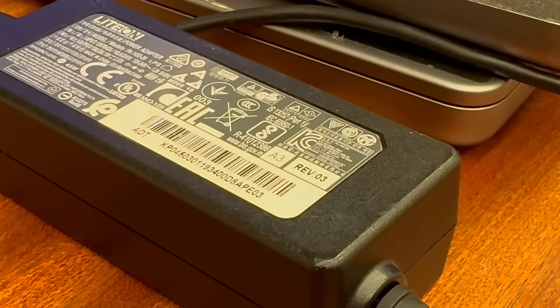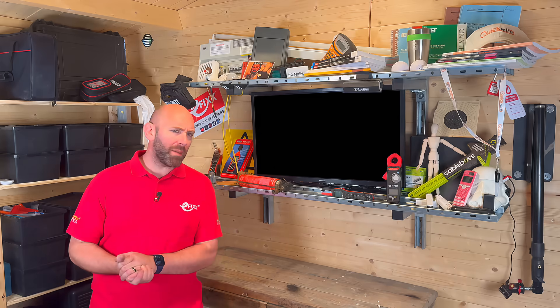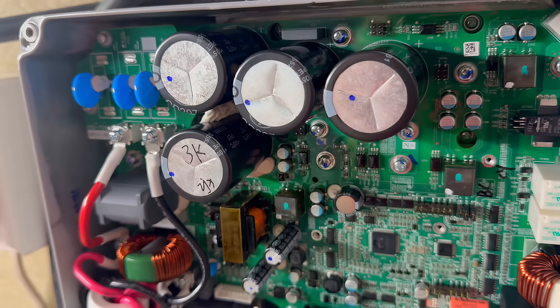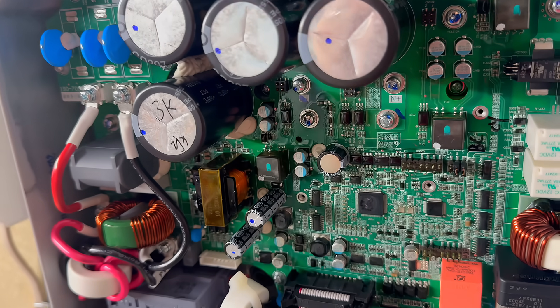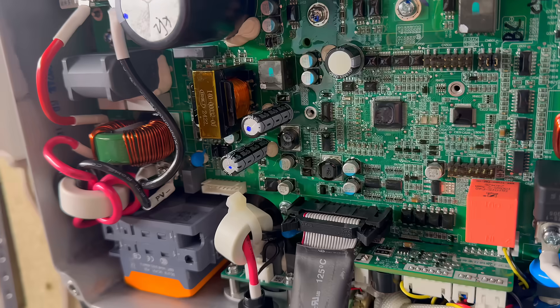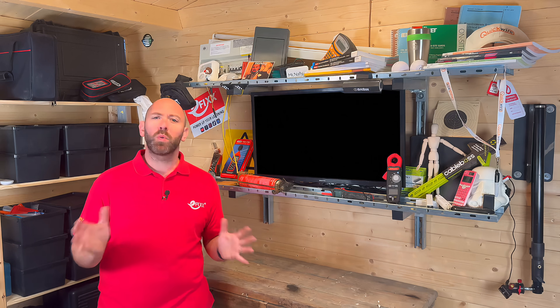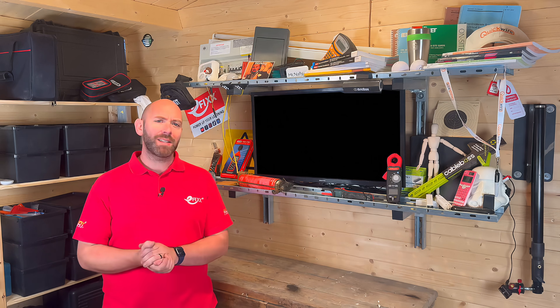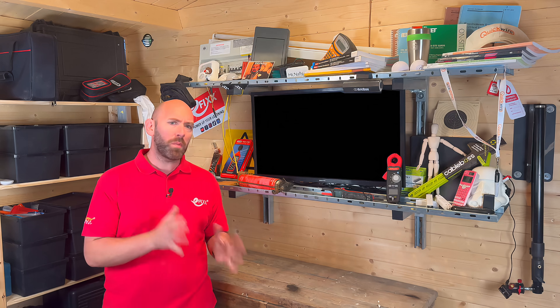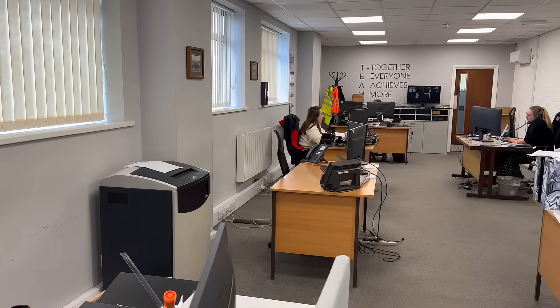And in most electronic circuits, the culprit is the power supply. Inside, you'll usually find capacitors that filter out transients — those short bursts of energy that could otherwise damage the electronics. But the way those capacitors are connected means they create a path to earth, and that's exactly where the leakage current flows. DC leakage has always been a problem. We've known for years that electronic devices dump current into the protective conductor.